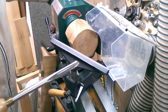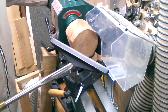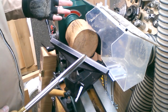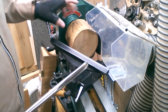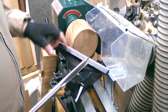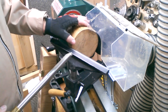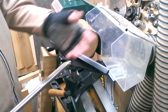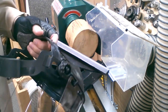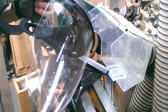I've got that mounted on there with good clearance on my tool rest. I only used four screws on the face plate — some folks like to use all eight, but for something this small and light it's not really necessary. The screws are long enough to give it plenty of purchase so this is not going to go anywhere. I'm going to start with my 5/8 bowl gouge and just start some shaping here. I'm going to see how effective my dust collection is today, so that's why I have the hood right here. And as always, it should go without saying — face shield, whatever you want to call it, use it. Be safe.